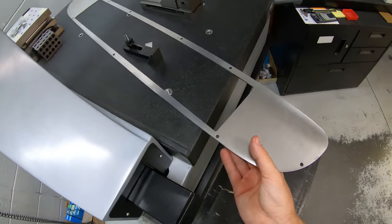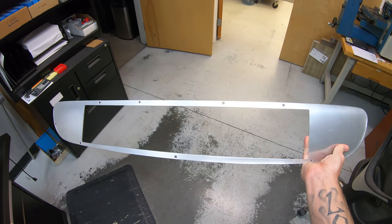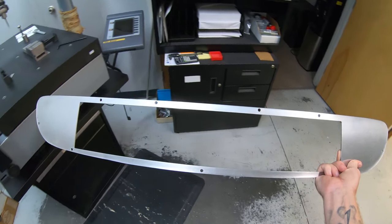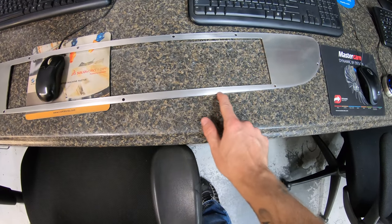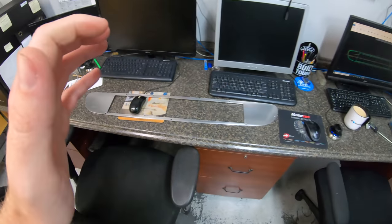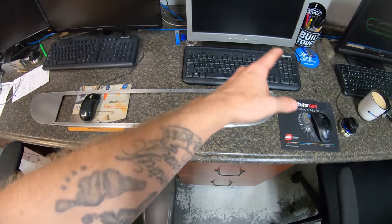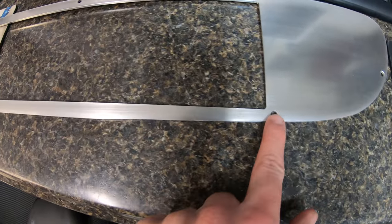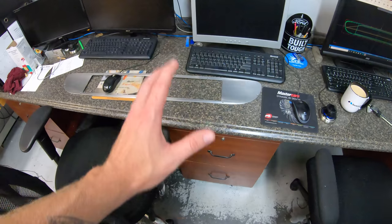We had one made already. If you guys didn't see, I updated you guys in my last video. Make sure you guys watch all my videos so you're not out of the loop. But we made one and needed a little tweaking to do. Basically, it's still rubbed in these areas here, and then it's got this funky little divot to it because drawing that up was a pain because I had nothing to really go off of. So I basically just plotted a ton of points and got it as close as I could. And it came out pretty good, but it does have this little divot to it. So I went back in there and smoothed that radius out and adjusted some things.